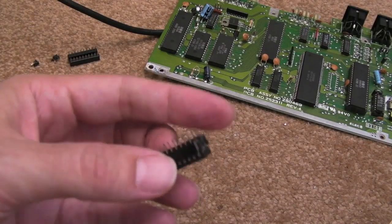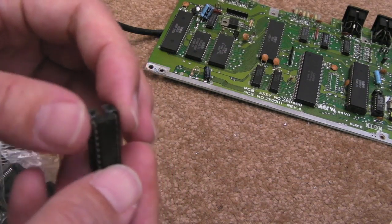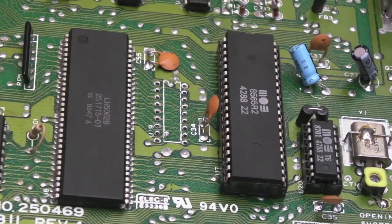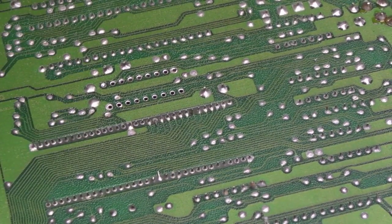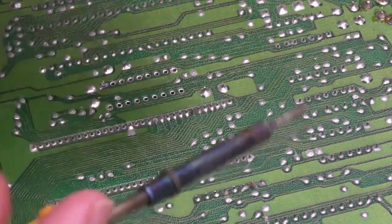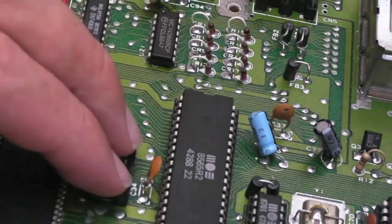I fashioned the socket there - all I've done is trim the end off and file it down so you get a nice perfectly smooth edge. It's not a very professional way of doing it - I prefer to put a new socket in, but I haven't got one. I may as well make sure it looks okay on the board. I need to clean the pins up on this chip obviously. It's pretty tidy despite the fact I've cut it. There's a bit of solder block in one of the pins there. Just solder that in place now.